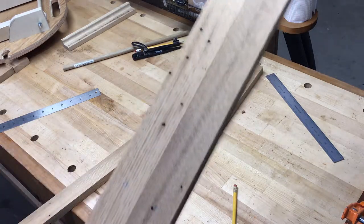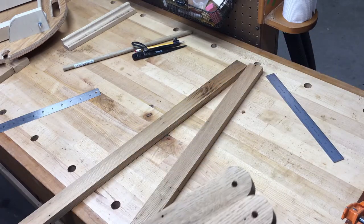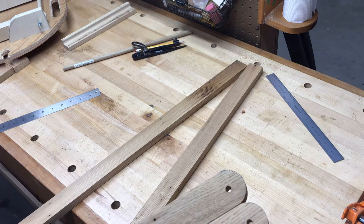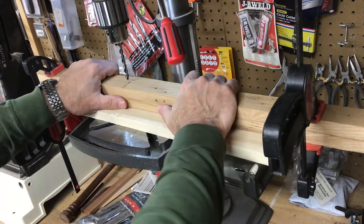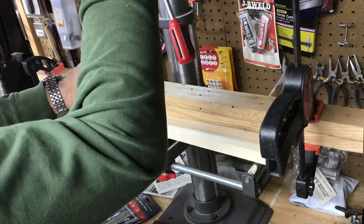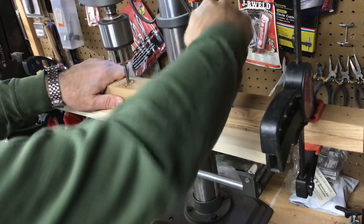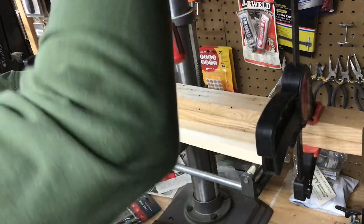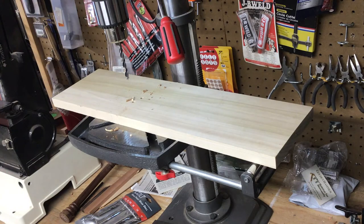I marked the pivot locations on the permanent leg. I want the holes to be in the exact same place on the two legs that go together, so I'm going to clamp each to its respective leg so that the pivot holes are in the exact same place on both. I'm going to mark the bottoms A and B so they will always be assembled together. I have them clamped together and I'm going to set them on the drill press — perfectly through both pieces.